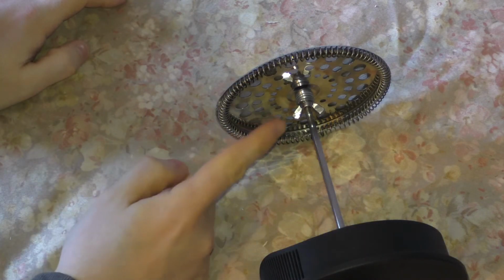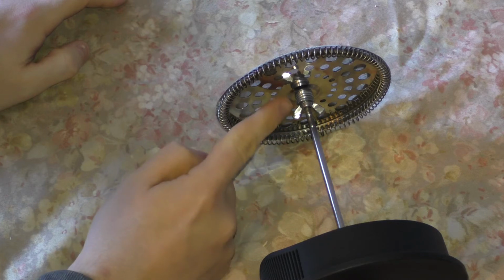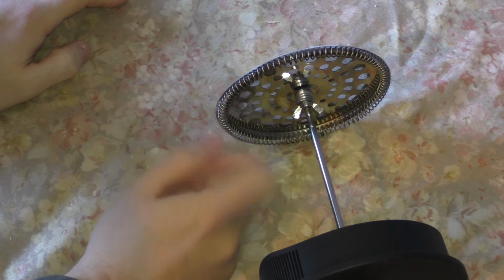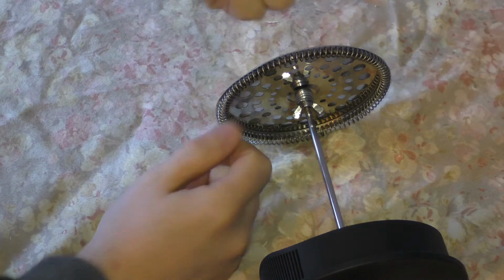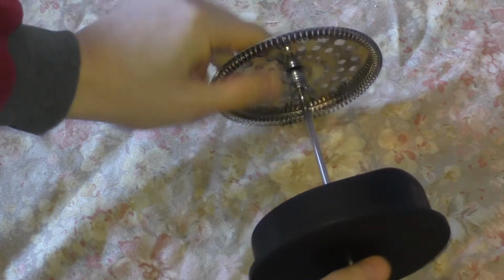So the solution is just, rather than some nuts, I've put a wing nut on there, and then a stack of 4 M6 washers. They happen to be just the right size to go over that shaft. And they press down nicely. So you just screw the base up and then screw the wing nut down, and that is held good and firm.